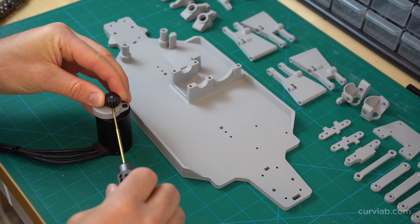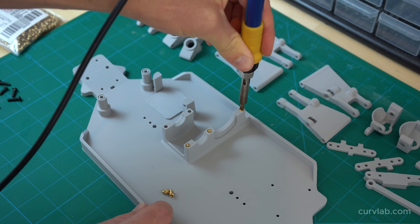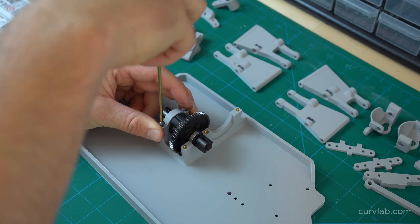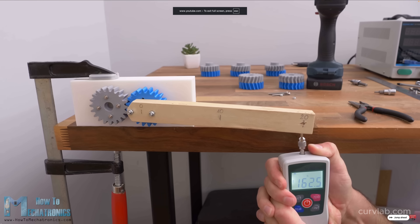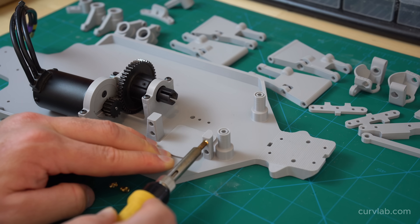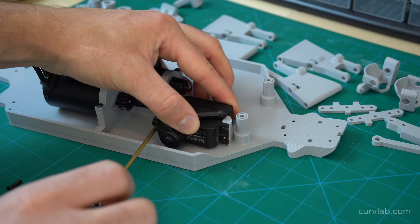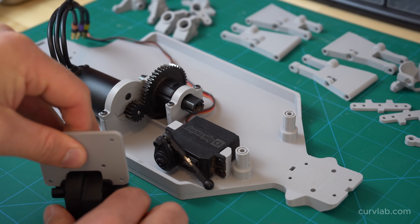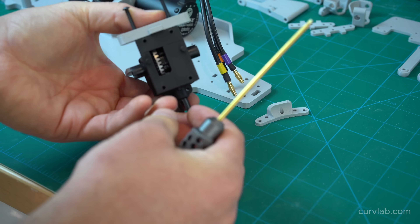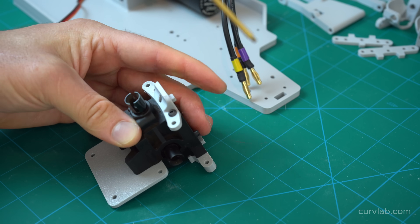I designed all the parts to be more substantial based on intuition, but I'm really curious to test them and see what parts, if any, fail and need to be redesigned. One challenge will be redesigning the drivetrain. I've seen enough 3D printable gear videos on YouTube to accept that spur gears are not going to be the best option — there's just too much wear and tear for plastic 3D-printed gears to work long-term. I really want this chassis to be robust and last just as long as an off-the-shelf chassis, so I'll implement a different drivetrain. Right now I just want to test all the low-hanging fruit before launching into redesigning the whole drivetrain.